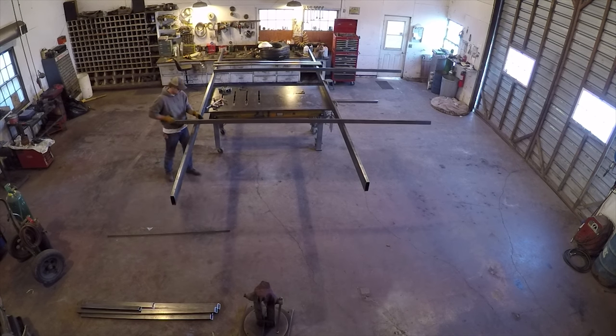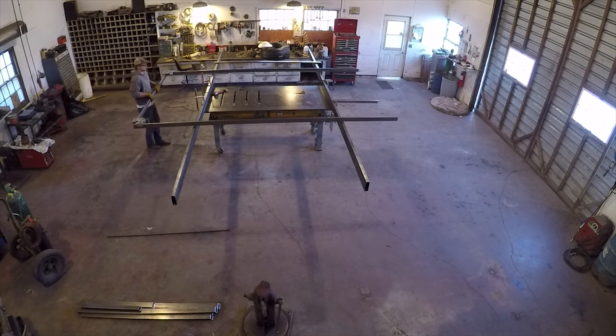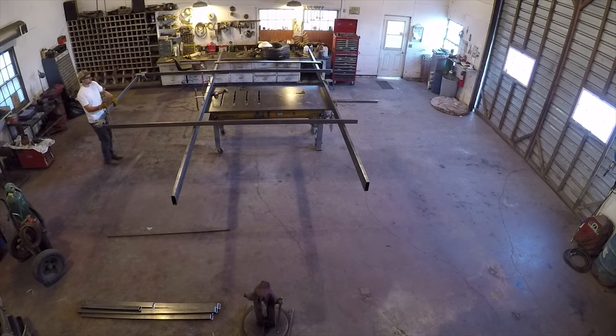I wanted to use my corner jigs for welding all 4 sides of the frame together. To make it easier, I slid the door down so I could set the top piece on top of the support while I got the jigs in place and everything clamped down. Then I slid it to the other end using the hoist to help hold it so I could attach the bottom piece of the frame in the same fashion.